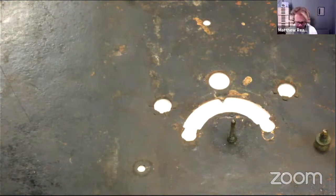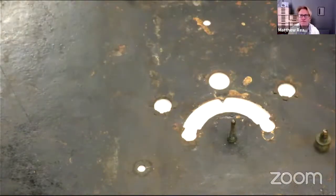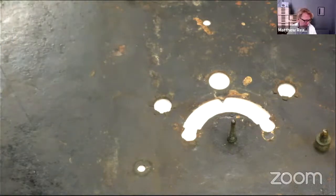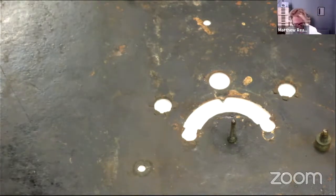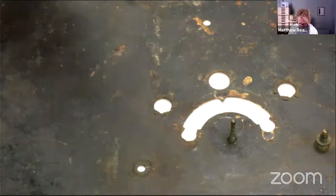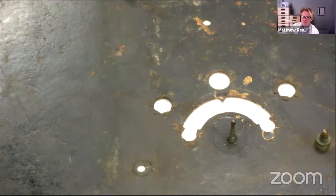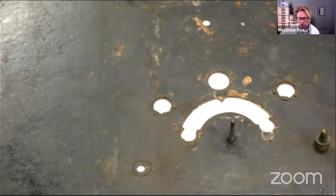So let's just turn our attention for the next few minutes onto our dial feet. So we've got three dial feet. And again, good point. Rather than riveting the new dial foot on, we can glue it in place. Nothing wrong with that. Good idea. So let's just have a measure up of what we're going to need. And looking at these dial feet, they're quite rough, for want of a better word. So that's good for us, because it means, I'm not sure my camera's focusing at all. That means that we can file the new component.